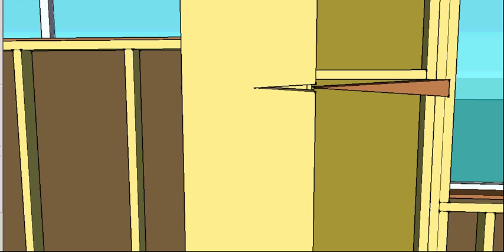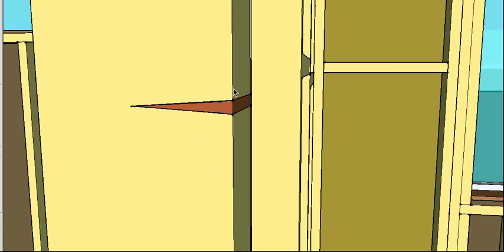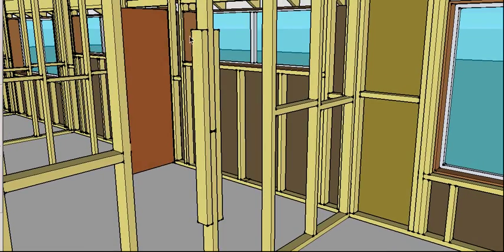So then we cut ourselves a wedge and we drive the wedge into the stud, and as we drive the wedge in, the saw cut will open up and we'll actually pull the stud back straight. You drive the wedge in, pull the stud back until you get it back straight. Once you've got it straight, you can skew a nail down through the wedge so it doesn't want to move, and then cut the wedge off, and then we put it on two cleats. Now in the timber frame code it says 42 by 19, but it's just as easy to use the same size timber that's in the wall already, so it makes it a little bit easier to put your noggins back in.